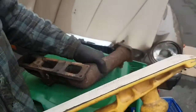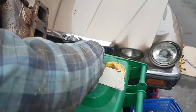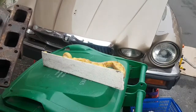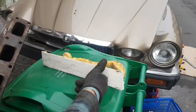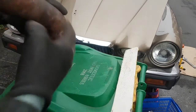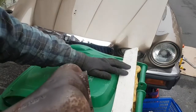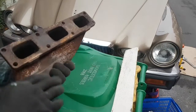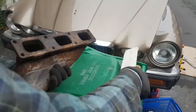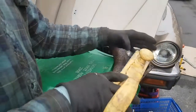I'll do the first cut with the body file. What I'll probably do - I've got some long strips of paper, I'll lay that down on wood on a flat block, and then I'll slide the manifold across it. This paper is very sharp, the other paper is slightly finer. I want to get a really good flat surface. It's just heavy to hold, so let me rest that down there - you can just about see it on camera.